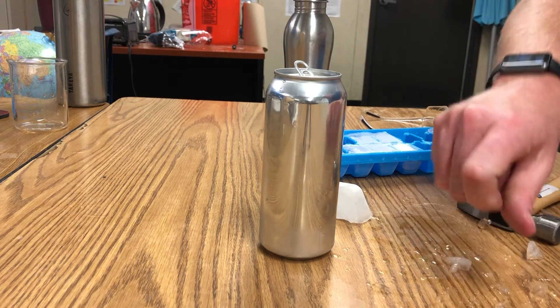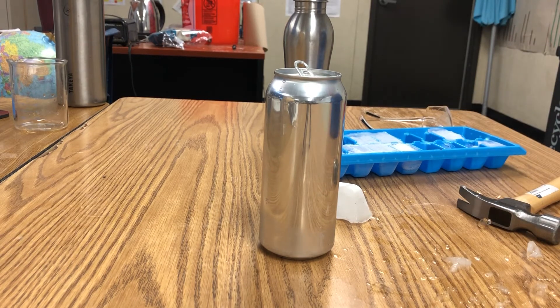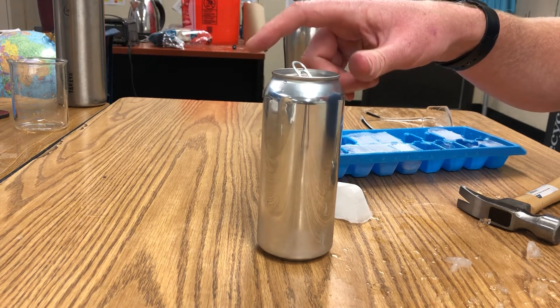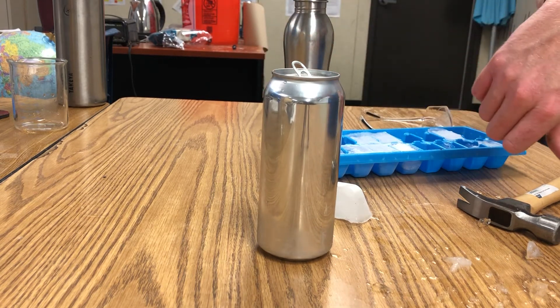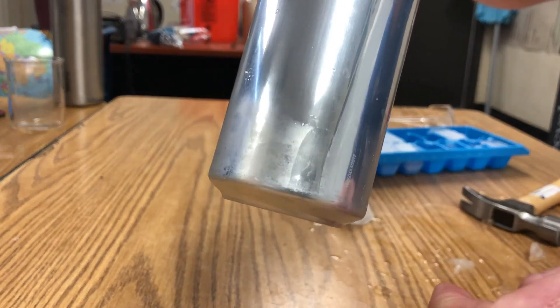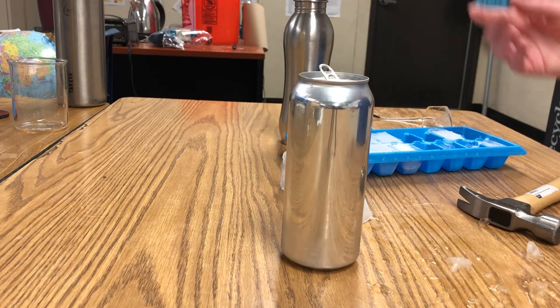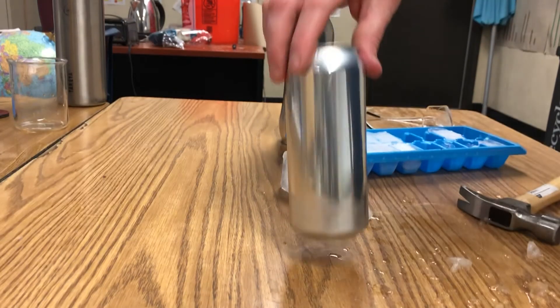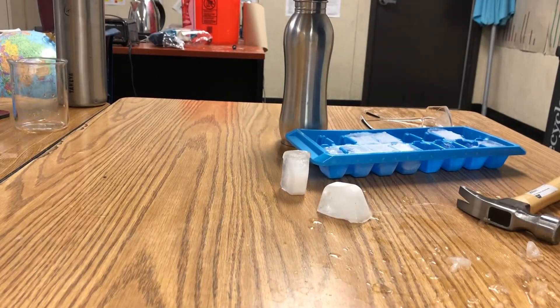It's very hard to see, but it's a little bit — this is why you've got to go slow, because it takes a little time for it to collect. But if I rub it, you can see, just barely, that it's smeared there — I managed to rub a little off. You can see how I can wipe it off there at the bottom. So it is starting to form. We are at the dew point. At this point, if I have a thermometer, I can just stick it in — whatever it says will be the dew point. You can see the dew there, it's starting to form. And I can wipe it off to show you that it is there. So we've reached the dew point.